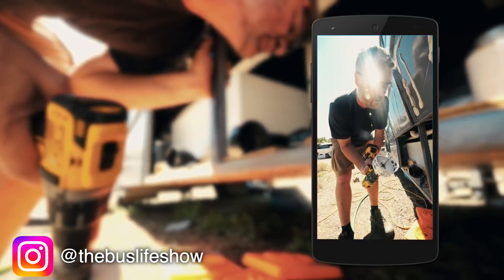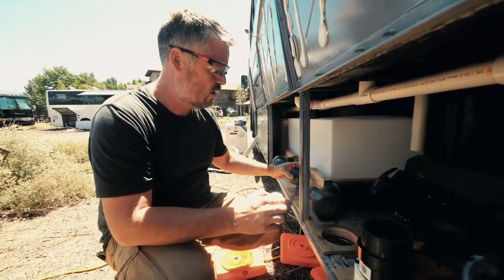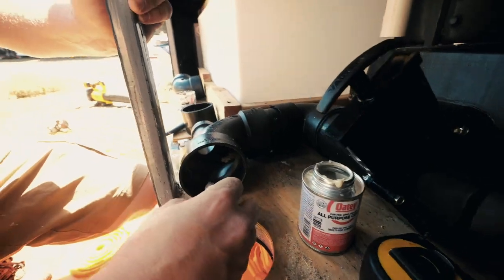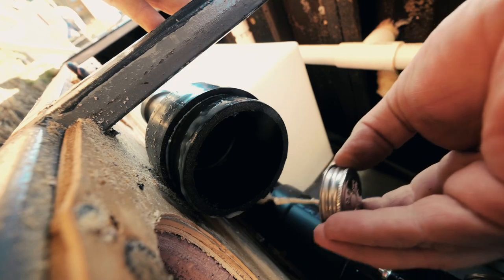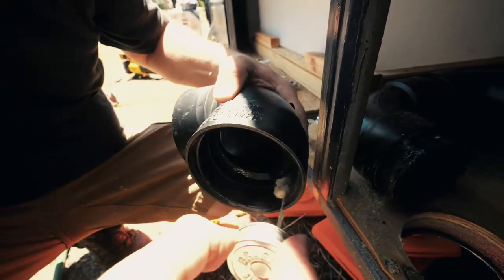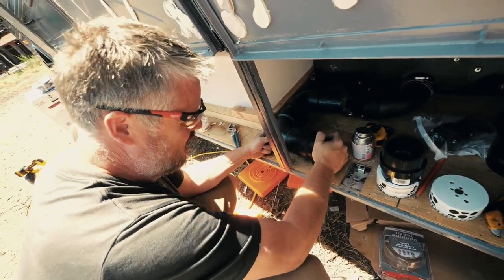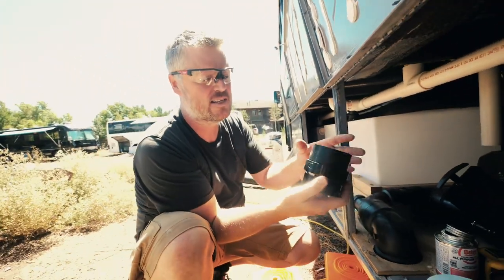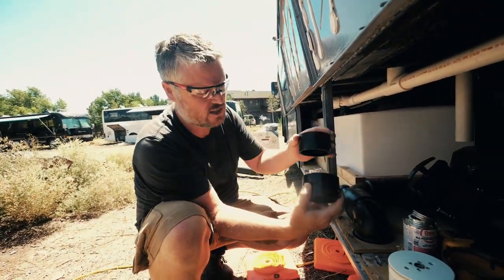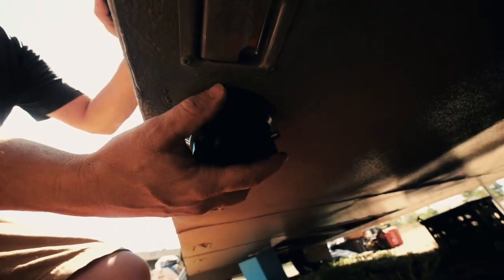That is such a drastic difference. I've got my two-and-a-half-inch piece cut here — get some glue on it, push in and twist and down we go, like a master plumber would do. Next is my piece that the sewer hose attaches into, and I want this snugged up as far as I can get it in there — we don't want anything hanging down real low from the bus.